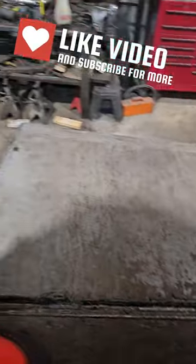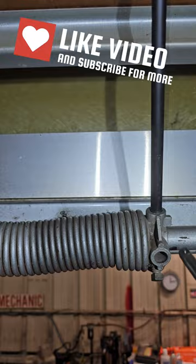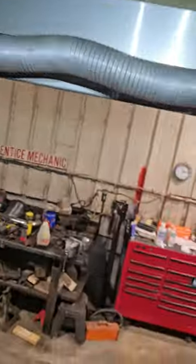This is for anybody that needs to replace a door cable. The first step: take a couple of 3/8s extensions and make sure that's all the way in the pocket. Start winding that spring back. Stay away from that spring in case it breaks — that will hurt you. It's going to go a little bit by a little bit. Take the tension off of those cables.